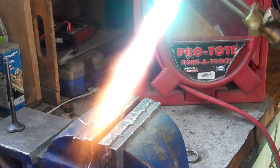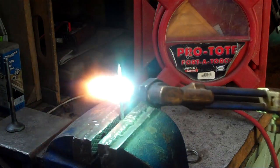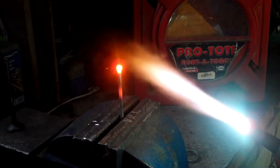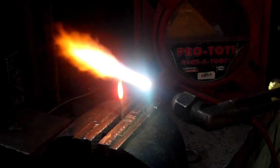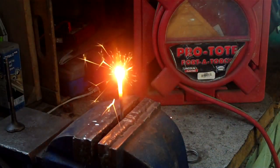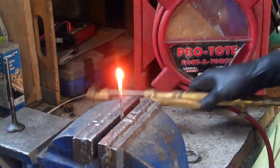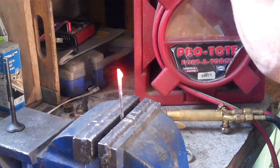A little feather going on here. So if you heat the nail, it doesn't heat up real quick — you see that? Sit on the nail, it takes a little while. You go to that tip and that tip's going to heat up right now and just go away. Heat the nail — heat the tip where it's thin, and you can just rock it. So that's the principle that I was talking about. I don't know how well that showed up on camera, but that gives you an idea. Wherever you have a lot of exposed surface area or the metal's thin, it'll just get rocked.